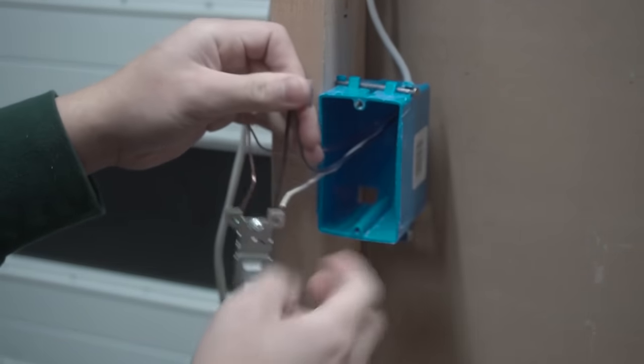Let's do a recap of the light fixture J-box. We have all grounds together — the ground for our 14-3, the ground for our 14-2, and the ground from the light fixture. We have all neutrals — the neutral from our 14-3, the neutral from our light fixture, and the neutral from our 14-2 wire all connected together. We have the red from our 14-3 and the black from the light fixture connected together. And we have the 14-3 hot wire black and the 14-2 hot wire black connected together. That whole mess is complete. Now we're going to move on to our last box — the receptacle.